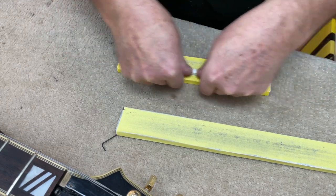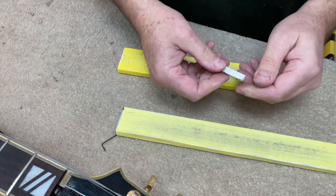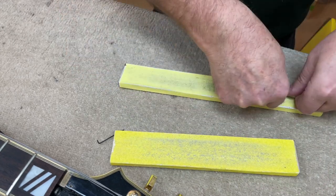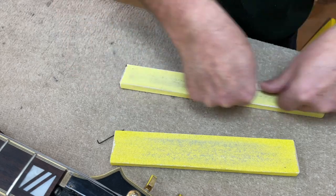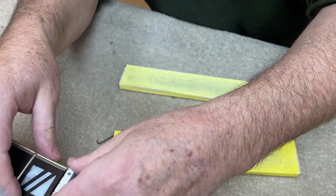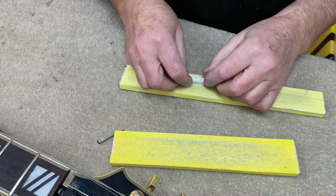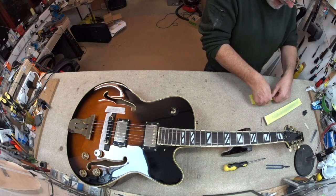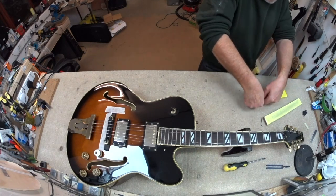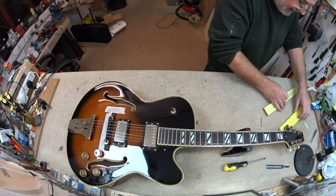of this, and this is a good thing anyway because it now renders the two sides flush to each other, whereas before there was just a little bit of overhang, a bit of excess on the 3D printed side. So this way it gives me the flushest possible finish between the two. That also takes it down a little tiny bit and starts to see whether it fits in. That's just, again, a fraction too big to fit in. So I'll just take a little bit now off the back side as well, just enough to smooth it out. Just trying to keep it equal, the amount I take off either side.